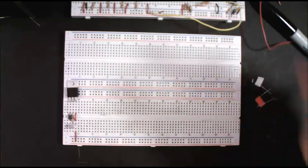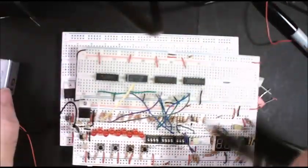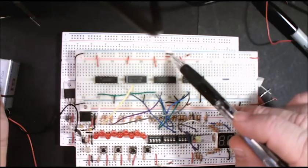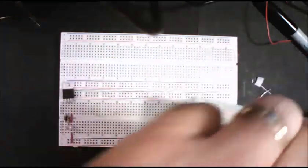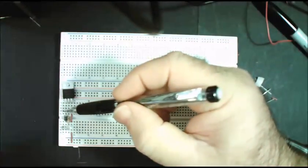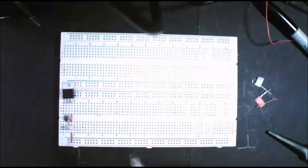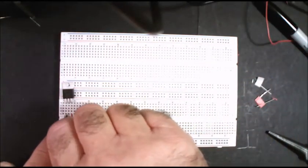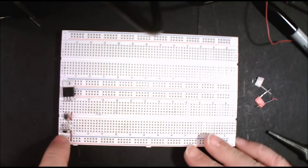Remember if you have a breadboard, the jumpers are needed to get across the barrier in the middle and to show you how these connect. The switch is going to go in row A, positions 1, 2, and 3. You're going to want to put a little bit of hot glue right down on that later on. Do not use bare wire in the power supply area — if something shorts out there, it's not going to be pretty. Shorting out causes your battery to get drained.